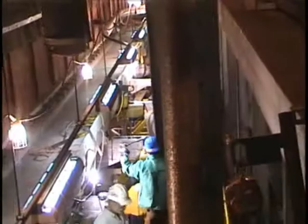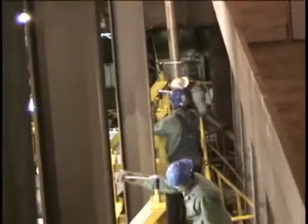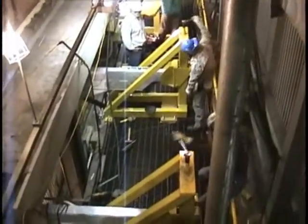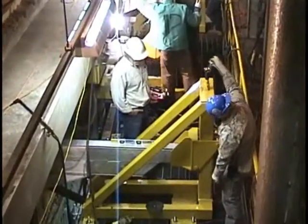Workers will then continue to raise the platform to the level position. Eight four-foot float levels placed on the top of each truss will help bring the system to a level position. There may be a marker on the receiver from where it was leveled during the last installation. Use this marker as a guide, but still use the float levels to double check.